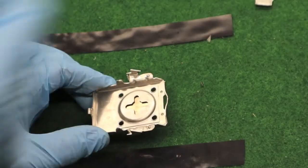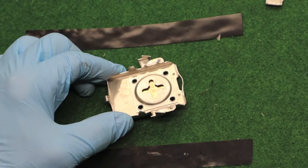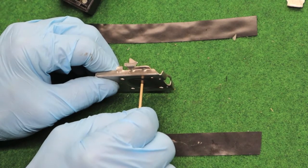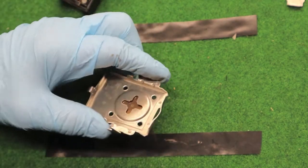She popped up. The plunger would have pushed up and opened up the contacts. We'll see if we can hear it cool down. Bingo. These contacts were normally closed. The bi-metallic disc only operates this much. Barely operates really.